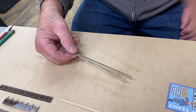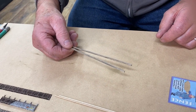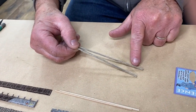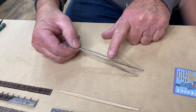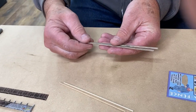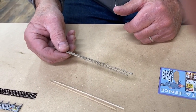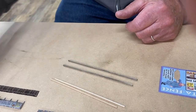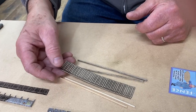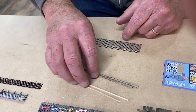One of the first steps I like to do is stain the rails on the back ahead of time, because once I put the glue on, the stain won't take where the glue is. So I like to stain them ahead of time. They'll start out like this, then we're going to stain them up and set them aside and let them dry. That way they're going to be dry when it's time to glue them to the actual fence pieces. Make sure these are stained up and completely dry when we go to glue them on.